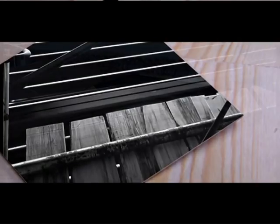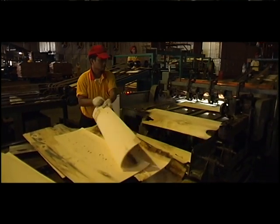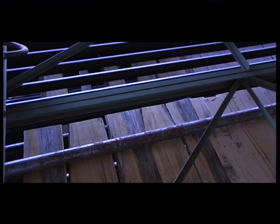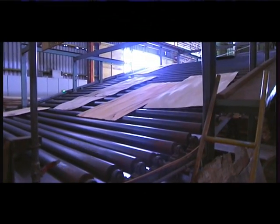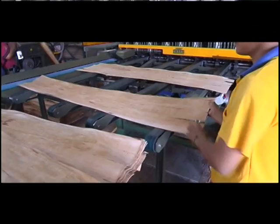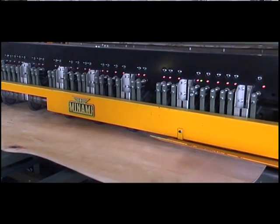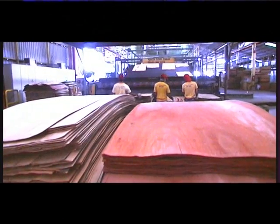Clipping: Veneer quality is one of the important factors in determining plywood grade. Defective veneers are removed by clipping off and burnt as boiler fuel. The clipping process results in some veneers having smaller surface area. To optimize timber utilization, these smaller size veneers are joined together to form standard 4-feet by 8-feet or 3-feet by 7-feet sheets.